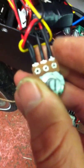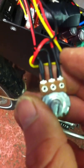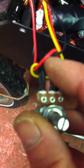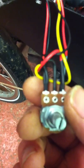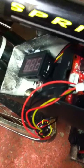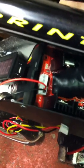As you increase the resistance you get higher output. So my thinking is: keep the 100k between red and yellow, and then put a resistor in series with the black. If you then increase that resistance by a switch powered by the output of the controller, you can switch to a higher voltage. What I've done is made a board that goes between the input socket and the output socket, basically to either have a resistance or short that resistance.